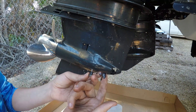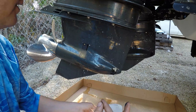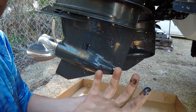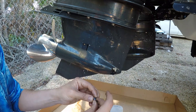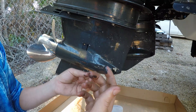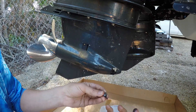This oil I don't think is specified from the manufacturer, because the new oil that I got from Evinrude as specified by the manual is actually clear. But the fact that this oil isn't white or milky — it actually still smells like gear oil. Even gear oil that goes in a transfer case or a differential of an automobile will smell the same way. As long as it still smells like gear oil, still feels like oil, and you don't really see a whole lot of metallics in it, you're in pretty good shape.